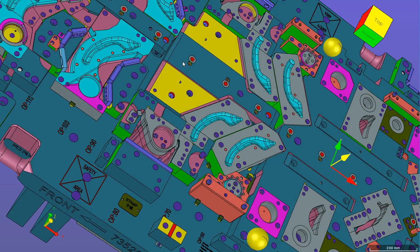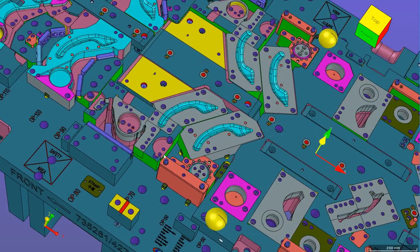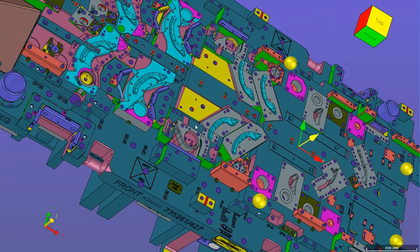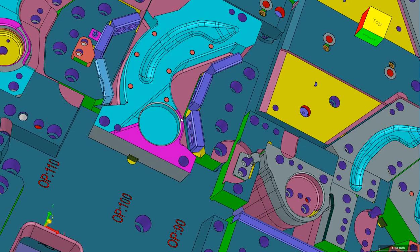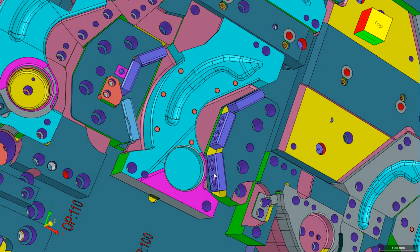Now I am going to show you the trim steel which has a one-side cut. On the left-hand side you can see a trim steel with just one side cut, so we have given a wear plate to counter the side thrust. In the next station we are having a flange-down — again a one-sided flange on each side — so we get thrust. To counter that we have again given wear plates. These wear plates are mounted on a holder, and when the flange steel comes down it will first contact the wear plate and then start flanging down, countering the thrust.